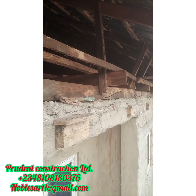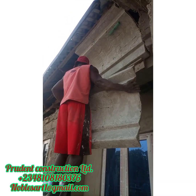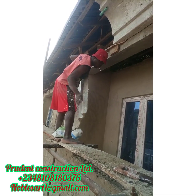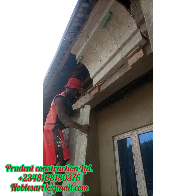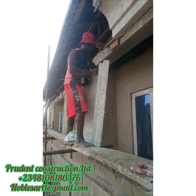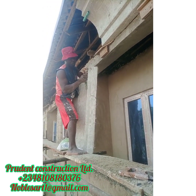Now let's start the installation. Cut your fascia according to what you can lift at once — this is very important. Installation is a risk, so cut it to what you can install. This fascia is one meter high and the breadth is 1.2 meters, that is 1,200.